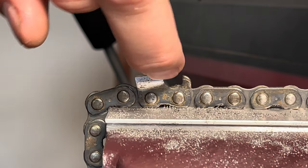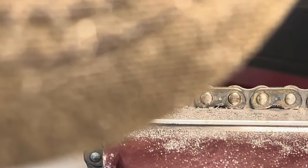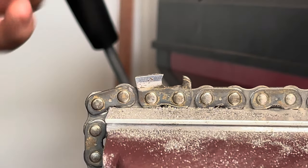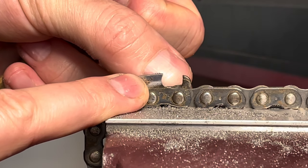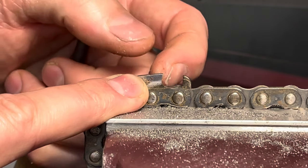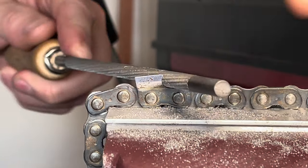We're starting to get rid of that gullet down there and now we're putting in a very small C. I'm going to keep going a few more passes. We're kind of there in terms of the rough shape, but now what we want to do is bring that whole thing back so that we have a nice C in there — this top corner which is currently damaged is removed. Bucking Billy Ray calls this 'the boat' and I really like it to hog up material. Essentially the handle starts up, you drop down, then you lower the handle and remove the material very quickly. Now I'm going to do passes where I'm literally just pulling back — not going down, not coming up, just coming back.